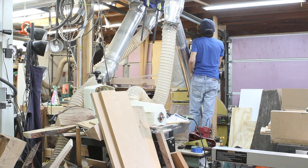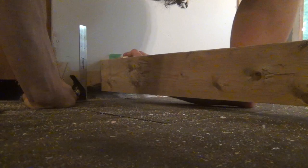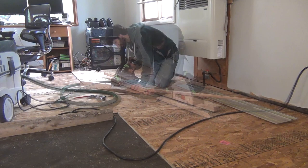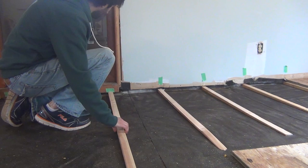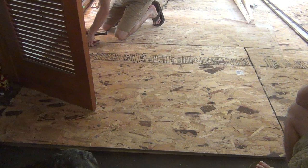This solved the dip on the right side, but the left side would still have to be shimmed. To figure out the size of the shim I needed, I laid my straight edge over the joists, measuring the rise and then measuring the run — in other words, the distance from the wall to the point where the straight edge starts to contact the floor. I could then lay that out on a piece of 2x and cut the shim with my track saw. Most of these ended up being about 1 inch over 52 inches. I then laid down some ¾ inch tongue and groove OSB over the entire floor. I also added some dominoes to the ends of the OSB that didn't have a tongue and groove joint.